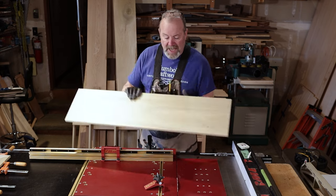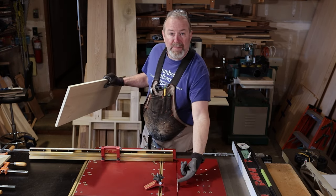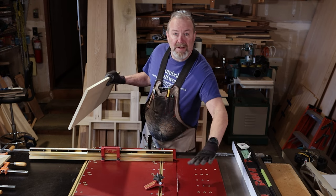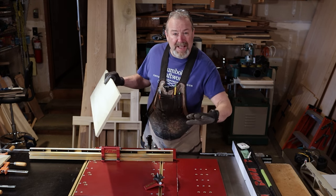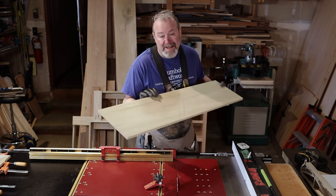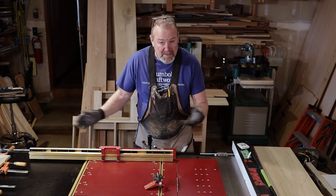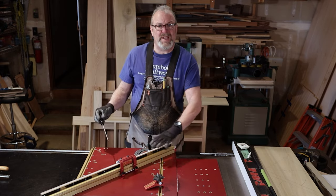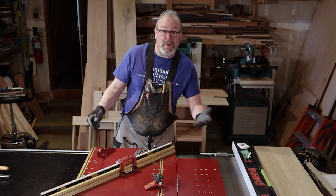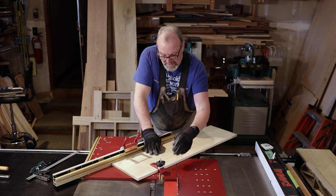The thing was, when I was cutting the interior ones here, I was cutting from this side of the blade and the piece was over here, so it was moving a little bit. Just that slight little bit over 8 cuts gave me a 16th of an inch gap, and it all adds up. So you have 8 cuts at 10/1000ths of an inch. It's pretty big. I messed around with this yesterday. I thought maybe this was off a little bit. It wasn't.